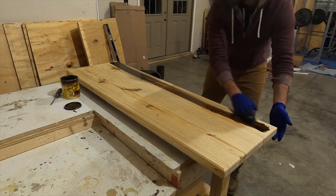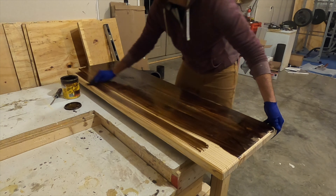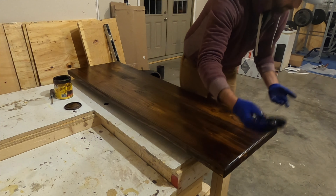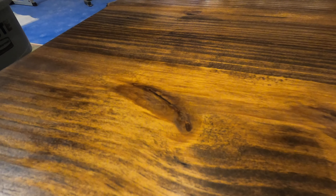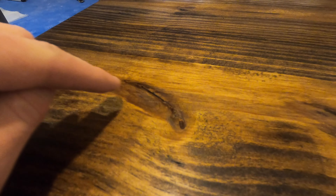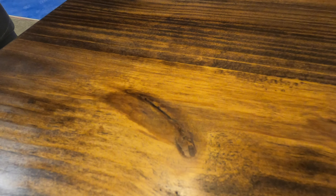Here's some additional bonus footage of me staining so you can see there is no discoloration. This is an espresso stain on the bench top and the Starbond finished it perfectly. Here's an up close look at one of the knots — it's filled in completely and completely flush after staining, with pretty much no discoloration from where I applied the Starbond. Another smaller knot right there — it fills in the gap completely with no discoloration from where the CA glue was.